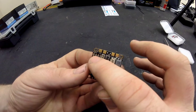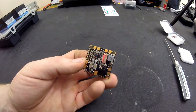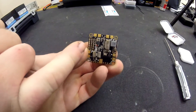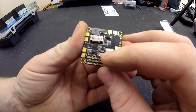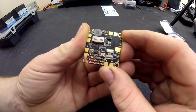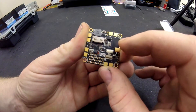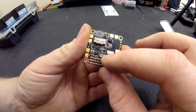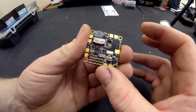There's another pad here that says RAM on it. This is what stumped me because I didn't have a clue what RAM stood for. If you look down here, there are two sets of jumper pads. The ones on the right-hand side are for your receiver. If you're running a Spektrum satellite receiver, it only runs at 3 volts. You can select 3 or 5 volts - you jumper the center pad with either the top one for 3 volts, or the bottom one for 5 volts, depending on which receiver you're running.